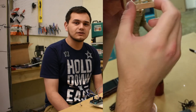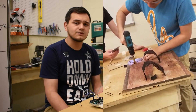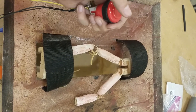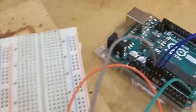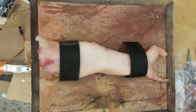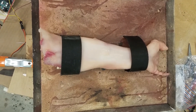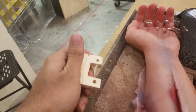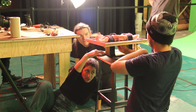The thing about wood is that when you cut so many corners, or cut something wrong, putting it all together might not be as optimal as a 3D model. The reason we chose animatronics over puppetry is that animatronics can be controlled with just the push of a button, and the arm movement would open. Our microcontroller of choice was an Arduino Uno, but when it was all done, the silicone skin on top was too heavy and there wasn't enough torque to move it — we only got a little movement, not enough for the shot. So we attached fishing line to both sides of the arm, pulled them apart, and it created the effect we wanted.